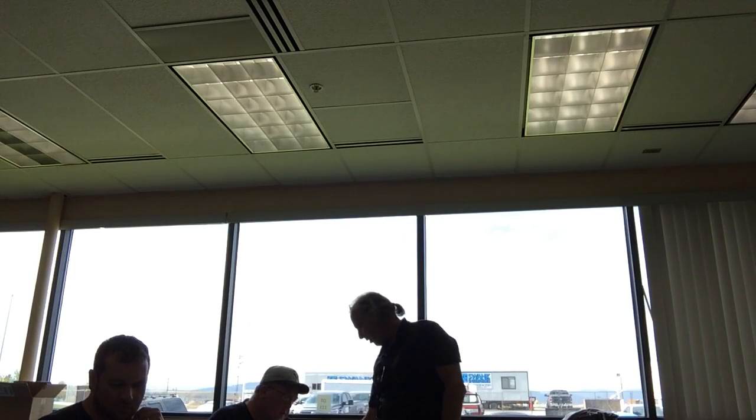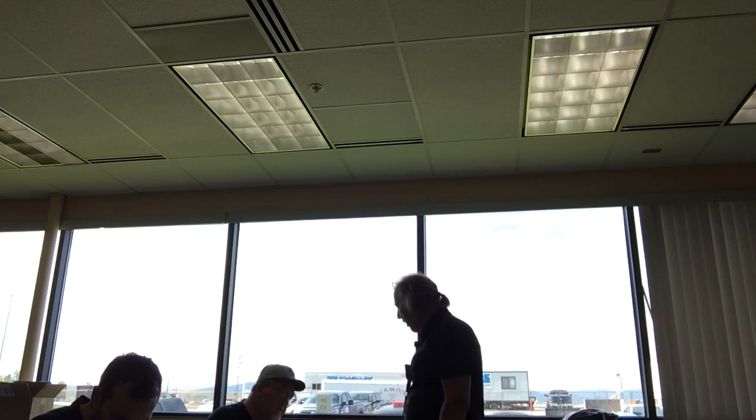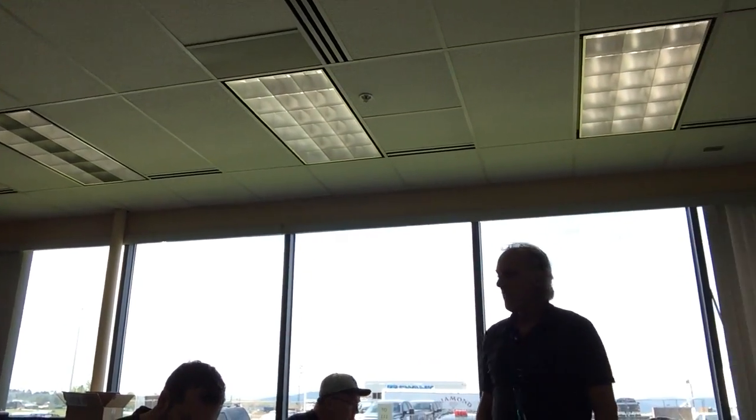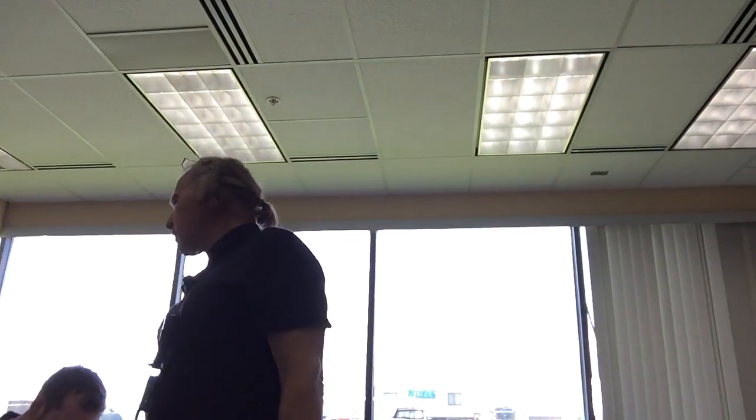Okay, so now you have voltages for each one of them? Mm-hmm. Measure them and see if that's correct. Are those the calculated voltages or the measured voltages? These are the actual. This is calculated. Okay. But you don't have a calculated one here for I. Oh, okay. I'll get I out of your calculated. Put a 0 in front of that 0.01. Anytime you write current, put a 0 in front of it, okay? Just helps people to understand what it is.